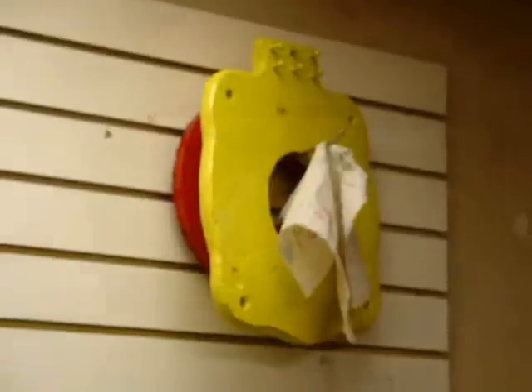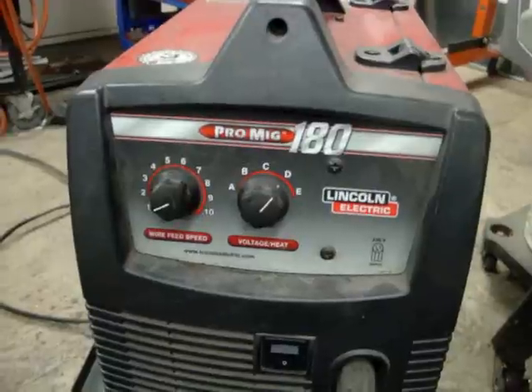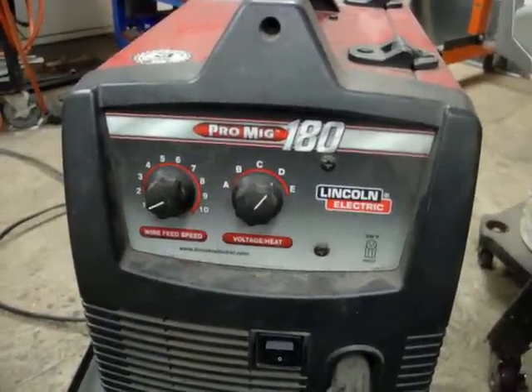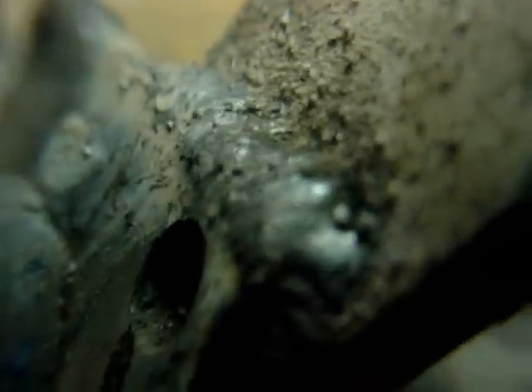So they're going to be a nice pair. Just to show you where everything's set: I've got the wire speed down on one, but I've got the amps not on full — so I figured this is probably about 110 amps. A whole lot better than 70 amps — makes a lot of difference. Here's a little better look. I took the chipping hammer and chipped off inside here, and we got a little bit better look at the welds. It's a lot nicer than the first ones — that's for sure.